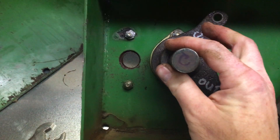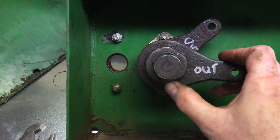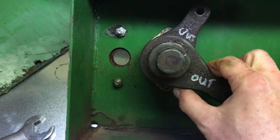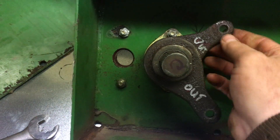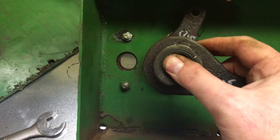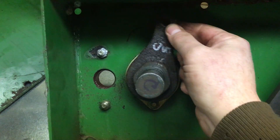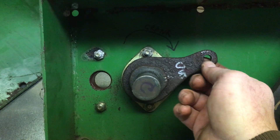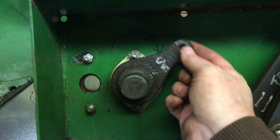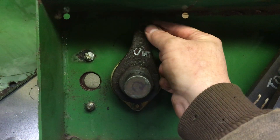What I'm seeing when I check here is that this cam arm — the particular one on the outside — is grabbing as it walks back and forth. But this one on the back is not. These just slide off. I index this one forward and backwards and you can see it's not cranking the shaft, which explains why it was putting out about half the rate of fertilizer.